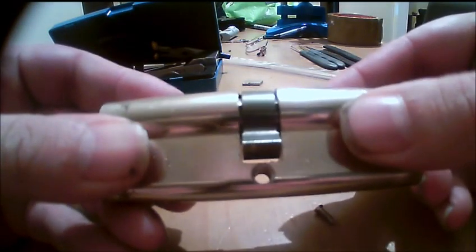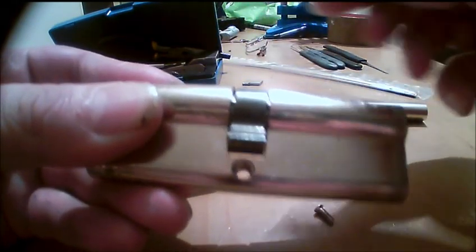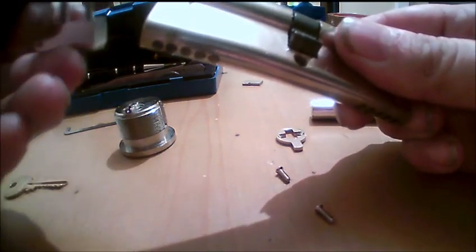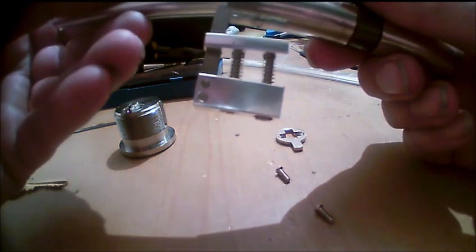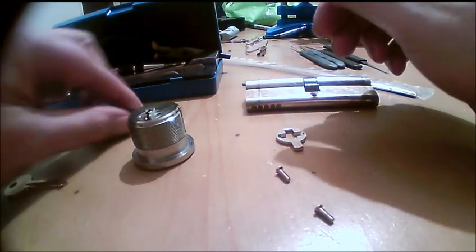Pretend this was cut in half — a half euro or something. When you take the clip off the back, you get a canal, and when you push your follower in, you have to hope the driver pin doesn't fall into that canal. If you do it this way — turn it 180 degrees, then put the pinning shoe in — the pinning shoe is already holding the pins down. When you push the follower in, there's no way you can trap any springs because they're already held down. So hopefully now you understand why your follower has a groove in it.